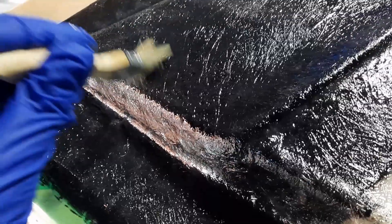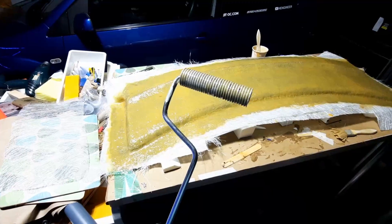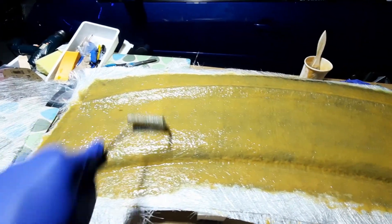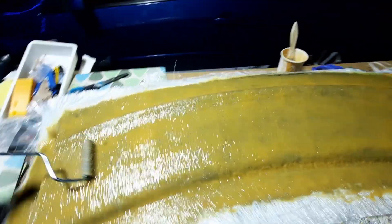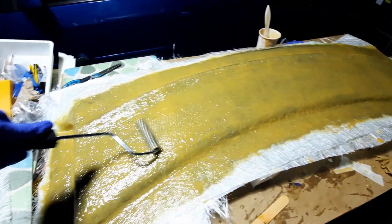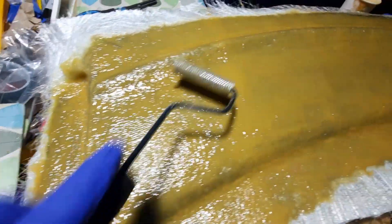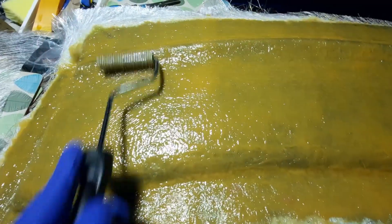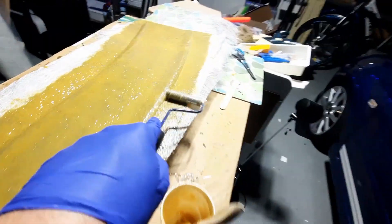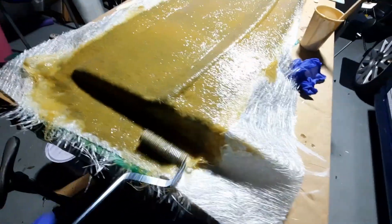Lots of meticulous stippling here to make sure all the air bubbles are pushed out from that first layer. Now I'm using a roller to move all the air bubbles out of the following layers. This is a much thicker chop strand mat — at this point it's adding the rigidity and strength to the mold, but that coupling coat on the thin tissue is there to make sure you've got a nice connection between these thicker layers and the more fragile gel coat underneath which makes the surface of the mold. Time taken at this stage is really well invested because it will lead to a much higher quality mold later.